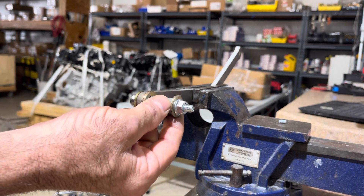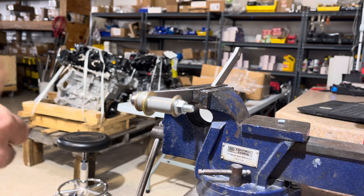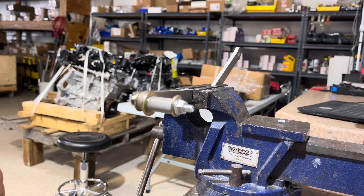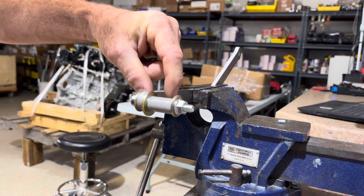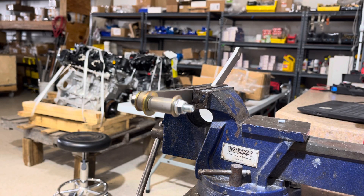Now, if there is a little bit of clearance in and out as far as on the wing, who cares? It doesn't make any difference as long as the flaperon is not rubbing against your fuselage. Not all of these arms are exactly in the proper position anyhow. So for good measure, and so someone doesn't come over to your plane and say there's something wrong, just put an L washer or a thin washer in there — that compensates for your paint. Or you can remove the paint from there, but obviously you'd like to have your plane painted. If you vinyl wrap it, just stop the vinyl right there and try it; if it still binds, remove the washer and put an L washer. And that concludes the explanation of the hinge pivot point on a flaperon of a Zenith aircraft.